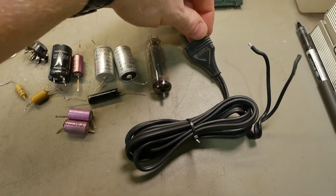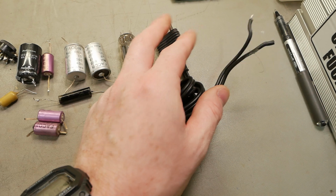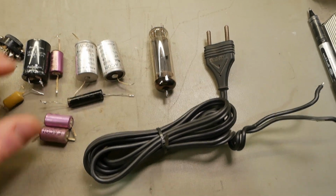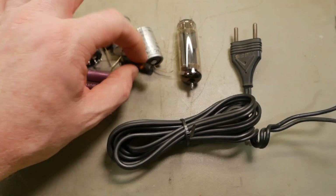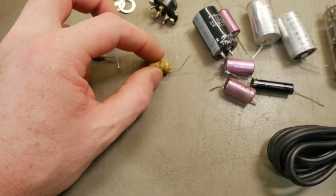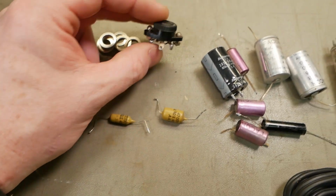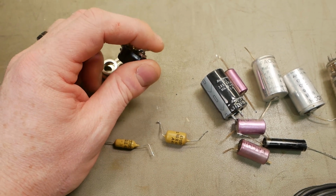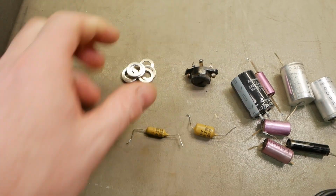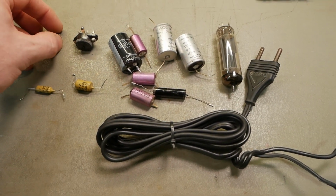All right, so what started off as just a replacement plug ended up being a new cord, three conductor cord with a ground pin on the new lead, so we had to ground the chassis, a failed rectifier valve, a full recap, removal of that cap, which looked pretty sketchy, the replacement of that leaky mustard, which is pretty rare for a mustard, but it does happen, removal of the cap that's made it sound like it had a blanket on it, removal of the unsafe main selector switch and hardwired to 240 volts, a fuse installed, and lock washers installed on all the jacks.